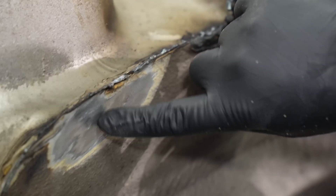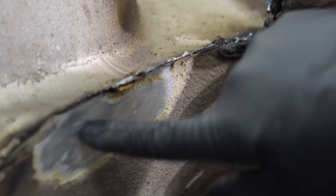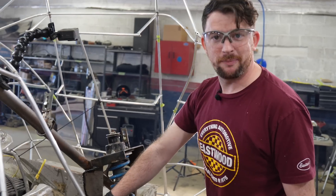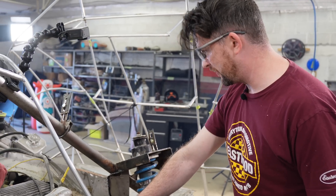I'm just making sure here that I didn't cut off the spot welds, especially this side, because this flange was so much shorter — the spot weld is actually down below here. This outer plate is spot welded to this inner plate. So I can actually go back even further and make it look even more seamless, but step one is cut back far enough to look and then go further from there.